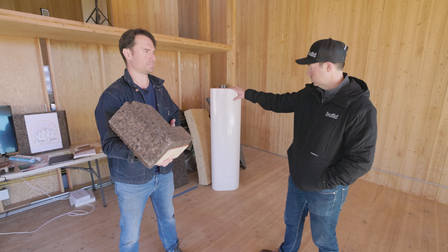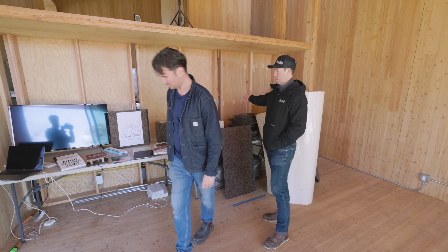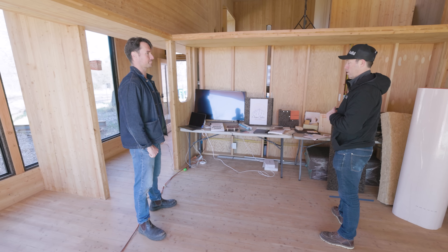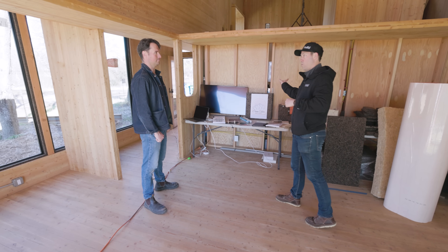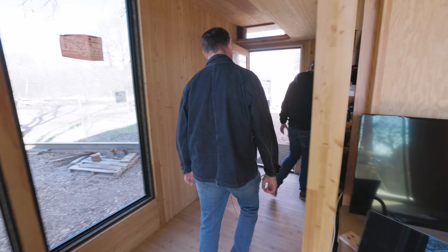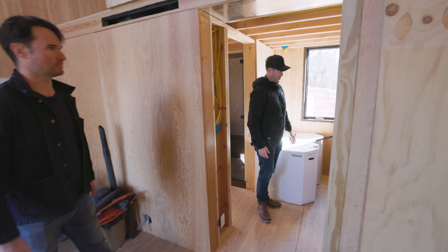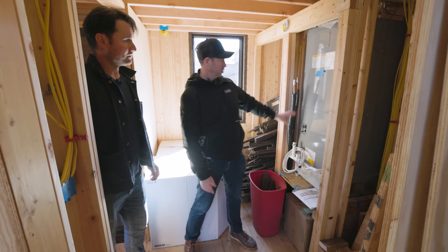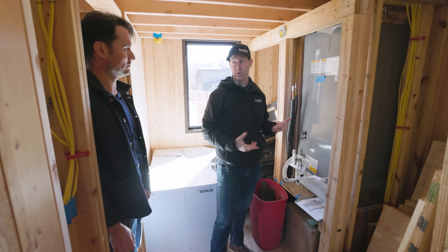This is the kitchen — the only place in the whole house that has stick framing with traditional electrical. What I like about this is if this kitchen were to come out, there's no drywall. My perfect wall house got a remodel and there were no issues with accessing everything. It's super easy to heat and cool a place like this — you just have one two-ton Carrier VRF system with a good Aprilaire pleated media filter, so potentially a MERV 15. A VRF upflow is going to heat and cool the whole open space — really straightforward and pretty cost effective.